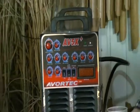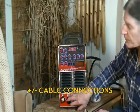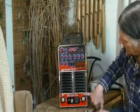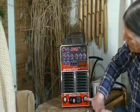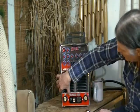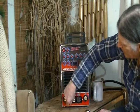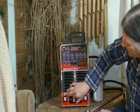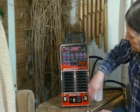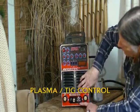We'll take a look at what's on the bottom. You've got your connection points for your cables, whether you're stick welding, TIG welding, or plasma cutting. You have a positive and negative output and a receptacle. This says it's a plasma pilot arc — that's your plasma arc connection. Air or gas. This is where you plug in either your plasma cutter or the TIG torch.